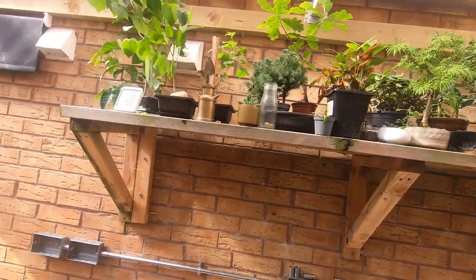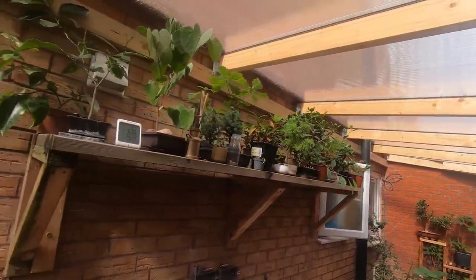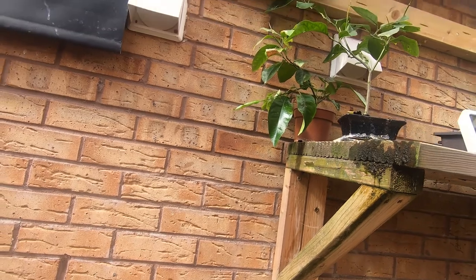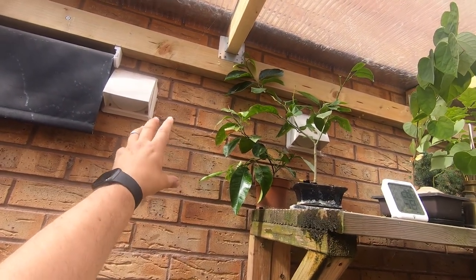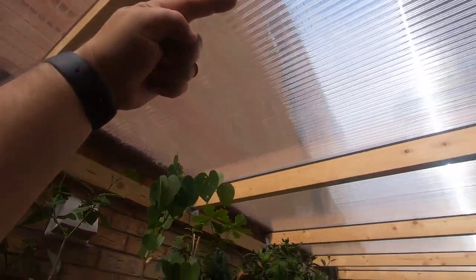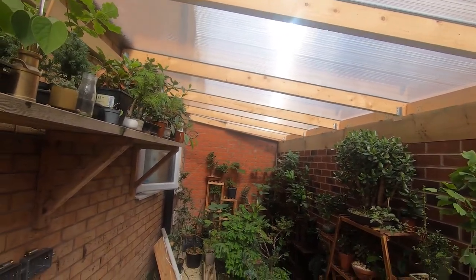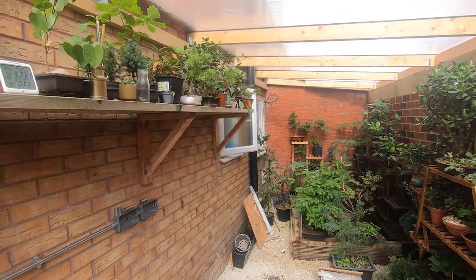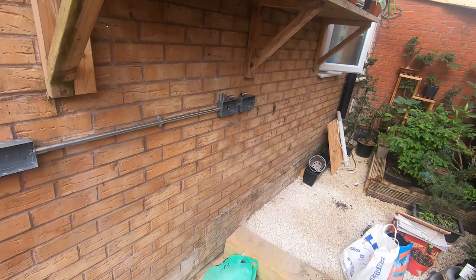And then what we'll do is we'll put the lights in on some Unistrut going across the ceiling, and we'll come out of here with some tube and a timer and whatever contactor and sensor that's required. And we'll go up and pick up the supplies for the lights and wire those in accordingly. But we can do that going forward, and we can just tidy up the rest of these sockets today.